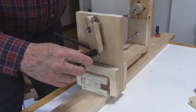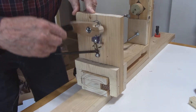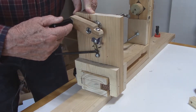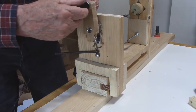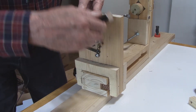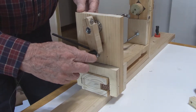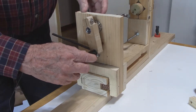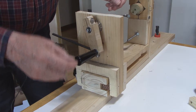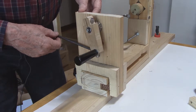This is a demonstration of the reversible locking ratchet. You turn it clockwise and it will not turn counterclockwise — it locks. Then if you want to turn it counterclockwise, you throw the lever and it will turn counterclockwise, but it won't turn clockwise — it locks. This is an important feature on mainspring winders because when the spring is wound up, you can release your hands and work on the mainspring and the spring won't come unwound. A very important safety feature.